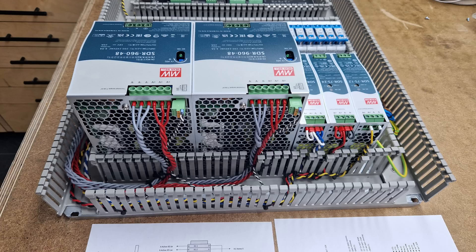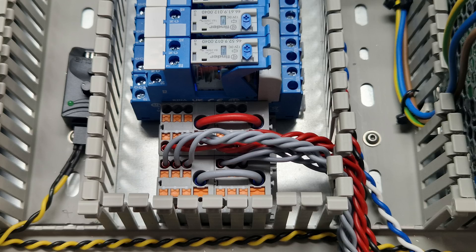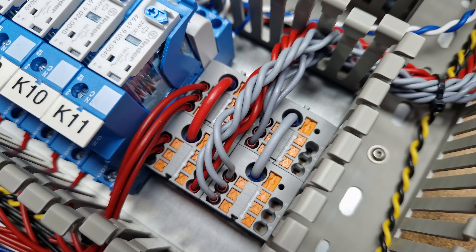Because there are so many components in the controller and the router running on 24V, I use distribution blocks again. I have a dedicated 24V PSU and circuit for the Z-axis brake and the magnetic valves for the pneumatic ATC functions, and a dedicated one for the CNC controller and the components it controls, like the relays, inductive switches, probes, etc. In addition, I have a distribution for the 48V power lines to the servos. This distribution couples the two PSUs in parallel, which gives a much higher margin for back EMF of the servos when they decelerate.